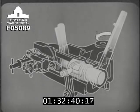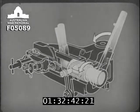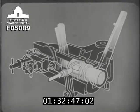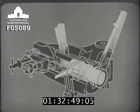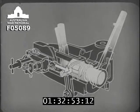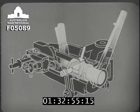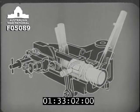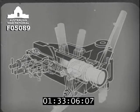When the LBM is brought to the rear, it will rotate the lock actuating cam. The catch plunger passes through the lock hand lever here and works in the left hand cam path. Except for a short, straight piece at the bottom, the path is bent to the right. So when the cam rotates, the catch plunger, riding in the path, is drawn to the right. Therefore, the lock hand lever and lock itself move to the right as well.